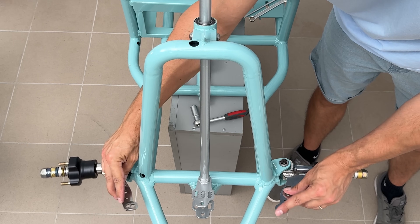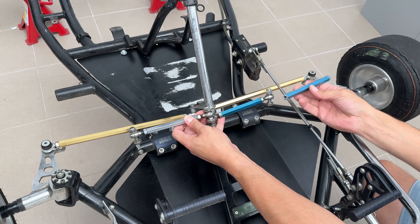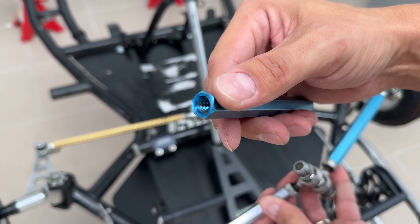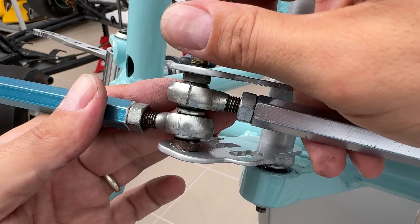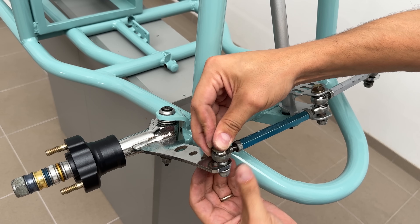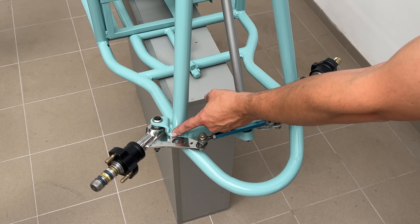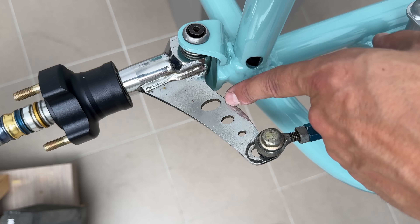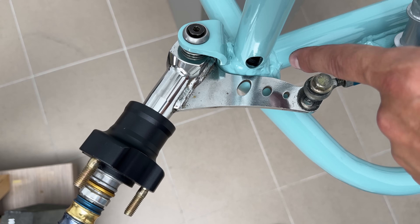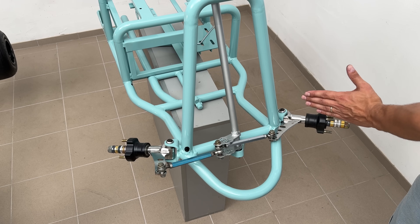Let's connect those spindles with the steering column. The rods and ends came from the donor — the only modification was shortening them. My rods had threads inside along the length, making this modification super easy, and since they were factory parts, installation was straightforward. The modified spindle shape follows the frame and allows the steering wheel to turn at maximum angle, which is crucial when going sideways and trying to keep drifting with the wheel turning to the max.